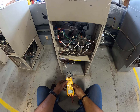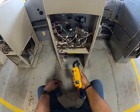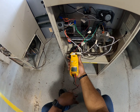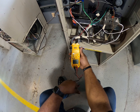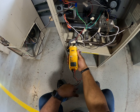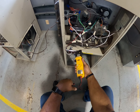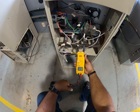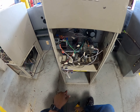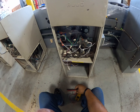So the first thing I want to do is see what blower motor speed is running. I'm going to check the amperage from my blower motor. Put it on low speed — no amperage really given. Put it on high speed — I have 6.94 amps. So that lets me know my high speed is running.